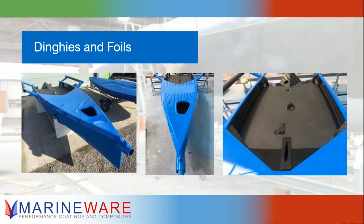Okay, and is that a foam cockpit or is that a non-skid cockpit? That is a non-skid cockpit. So the bare carbon work on the cockpit was all Durepox cleared with, I think it was matted down a bit, and then grip sprayed in with Durepox clear and Griptex.